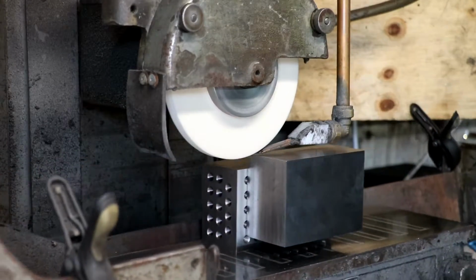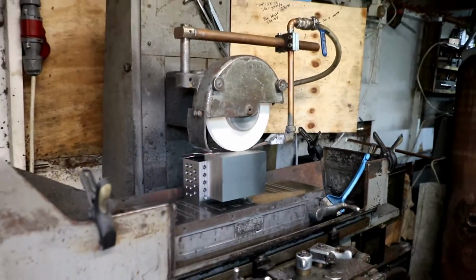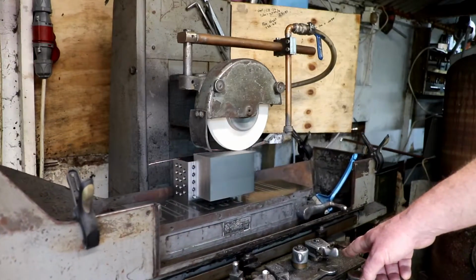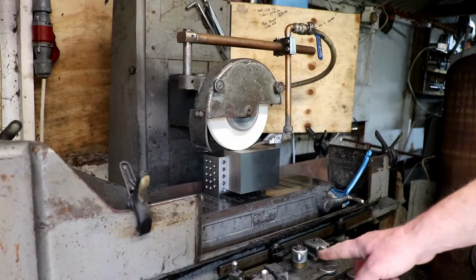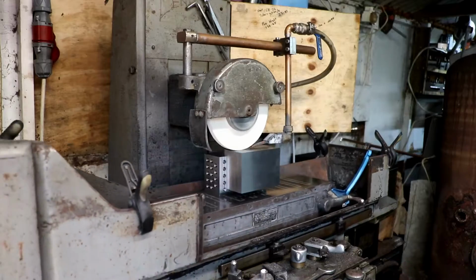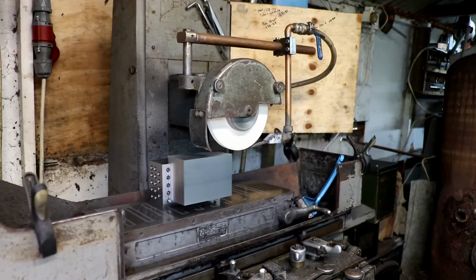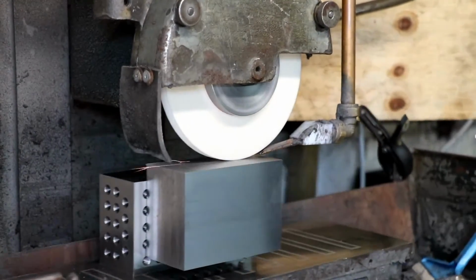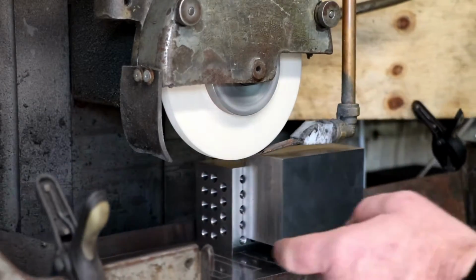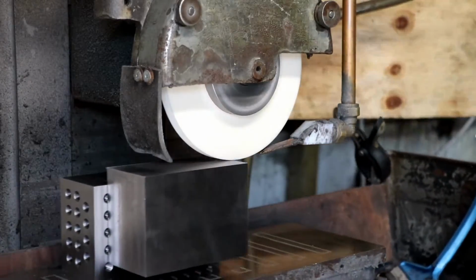And there was one other thing. You'll see, let me just bring you back out a little bit. Now, you can see that lever there, can't you, that orientates the table that way. Well, here is another little lever that sets the speed. Speed's maybe not the right word. It sets the ferocity, let's say, of how quick the x-axis bounces in when it gets to the end of its stroke.